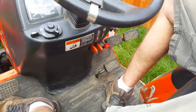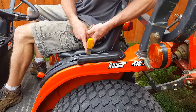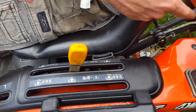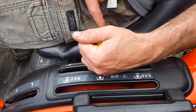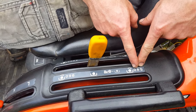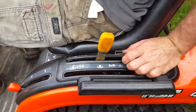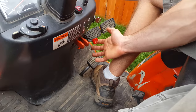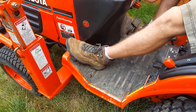So to start this unit, you're going to make sure, A, that you're in neutral on your PTO. This lever here turns your PTO shaft on the back — the drive shaft — on and off. It has to be in the middle neutral position. It can only go one way to the 540 RPM, because I have it locked out so you can't go to the higher RPMs — you don't need that. To start, you push that stop switch in to turn the fuel on, push the clutch in, turn the key.